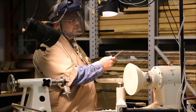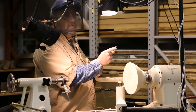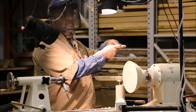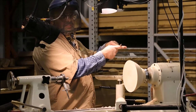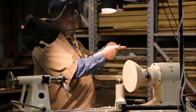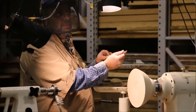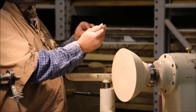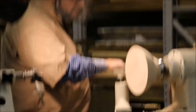I want to fix the rim here a little bit and take this sharp edge off. The next thing I'm going to do is go ahead and cut the little shallow coves on the rim. I'm going to use this scraper — it has an Ellsworth-style cutter on the front. I'm going to use this in shear scraping mode, so I will never hold it flat across the rest like this. I'm going to rotate it up to about 45 degrees at least, maybe up to 80. When I make my little cut, it's a little motion like this where both the back and the front of the tool move.